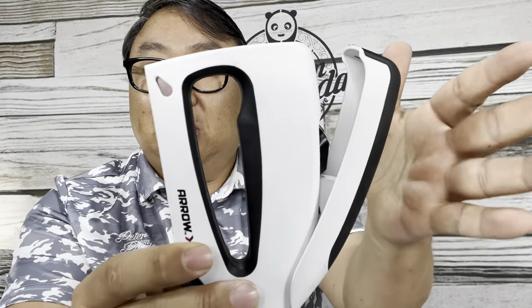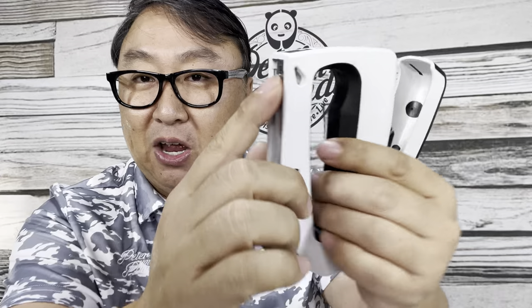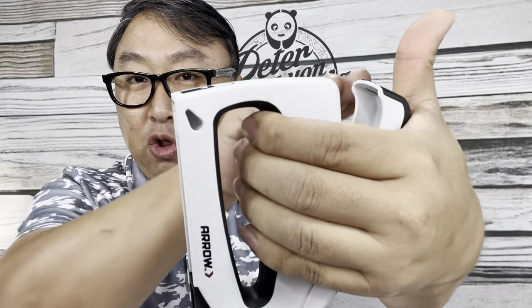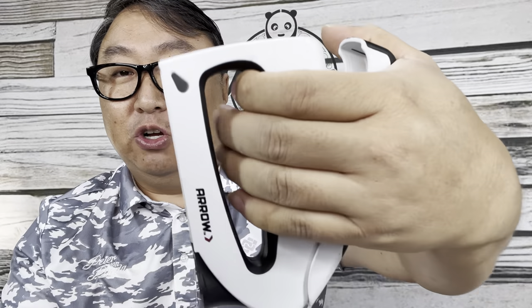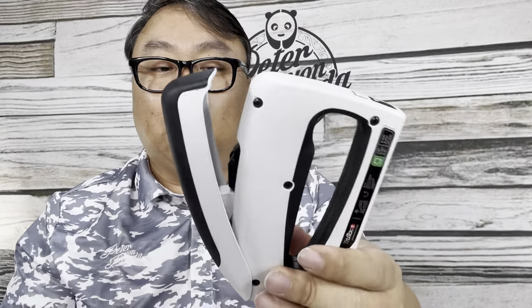Obviously the most interesting thing about this is the way the trigger works. On most staple guns the pivot point is up here and you're pressing down, and the problem is it kind of wants to pivot the staple gun up — you're pivoting where you want all that pressure. The nice thing about this is when you're putting pressure on it with the palm of your hand, you're putting pressure right in line with the staples themselves. The bore axis is very low to where you're pushing on the trigger — very similar to a 1911 backstrap safety. When you're squeezing here and holding it steady, you're also pressing here, and it's going to push this flush against the surface and fire.